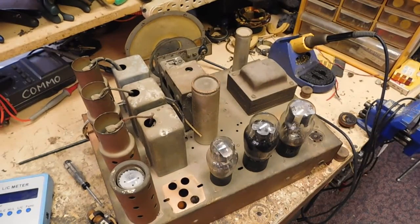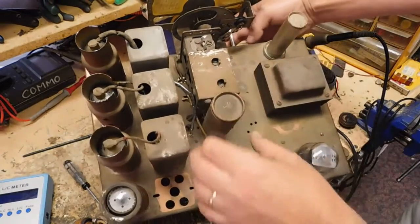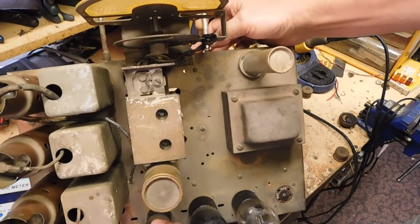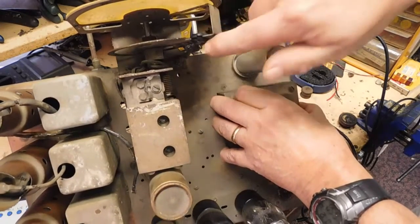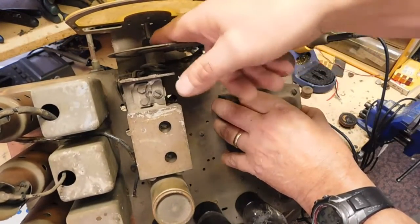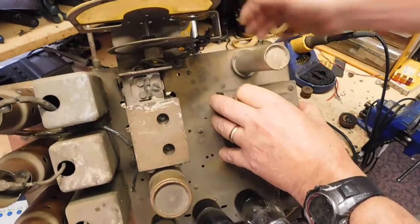Anyway, that's about all I got for you. This will be a future thing down the road. That tuning mechanism is right here. Let me see if I can move it around. Right here, if I turn the dial, it turns a little stiff, but you can see it there. The light bulb goes in here, and this rotates around on a ring, and down the bottom there's a rubber. The rubber's a little stiff, so that makes it kind of stiff. I've lubed it up, but anyway, the light follows along as you turn the dial.